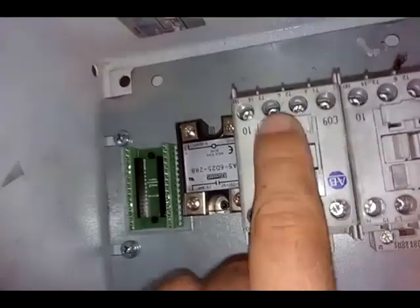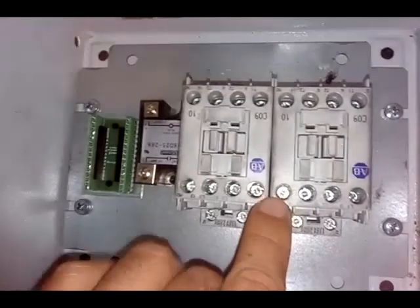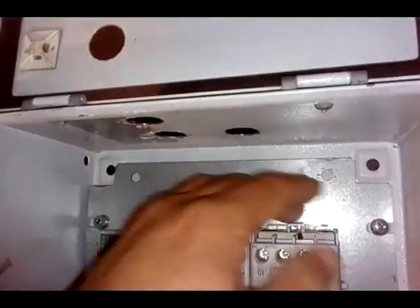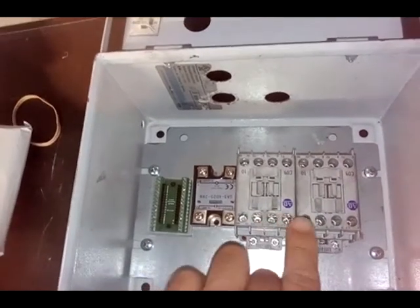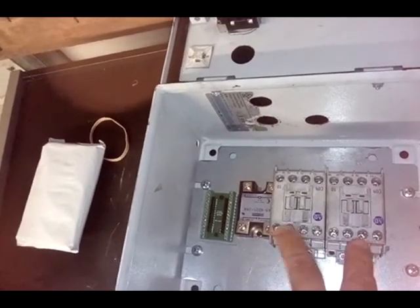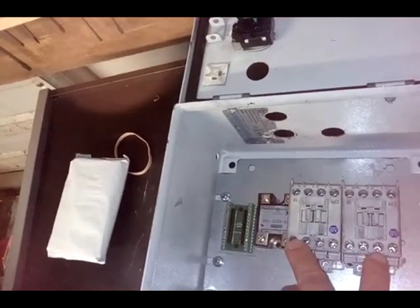The coils are 110 volts AC. These have four normally open contacts each, and I'm using various contacts in parallel so I can drive more current with them. The water heater uses 220 volts, so it uses two phases, and I'm using one relay per phase so the current and the arcing will not decay the contacts.